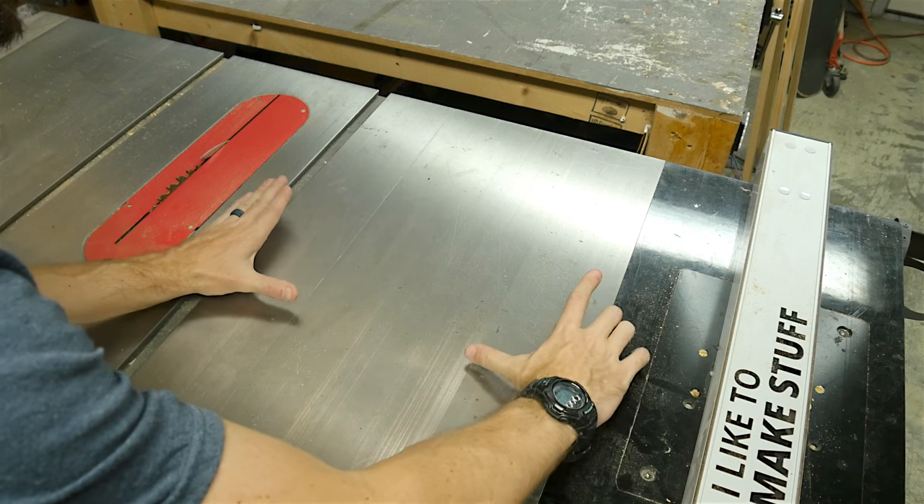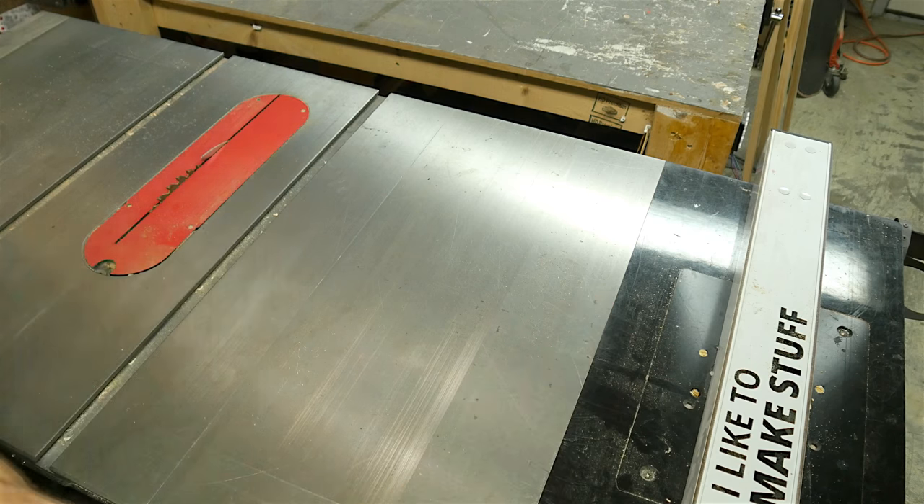Let me say something quickly about the cut I just made. It's not the safest cut because the distance between the blade and the fence was longer than the depth of the material being cut. When you have that setup, the material can easily twist and get bound between the fence and the blade — that's when you get kickback. Kickback can be extremely dangerous and the way around that is to use a crosscut sled. In this case my crosscut sled was not deep enough, so I took this risk. I went really slowly, tried to make sure it didn't shift, and had the blade down as far as it would go. It was still a risk and I just wanted to make you aware in case you were going to make a similar cut.